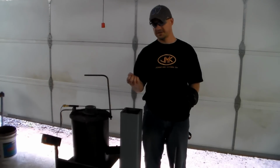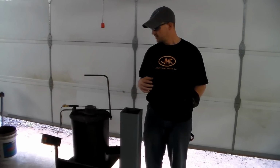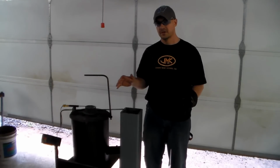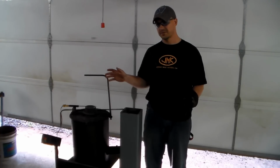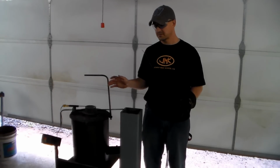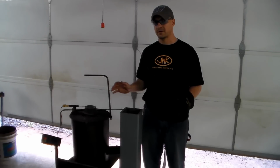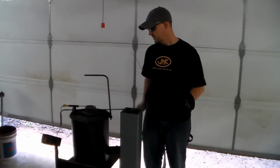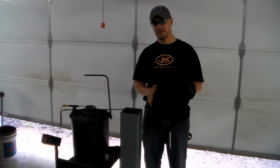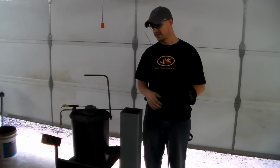and what that means in application is it's going to spit out and land on whatever is nearby. And so you can imagine we have that exact same concern with the salt, except we're dealing with nearly 1500 degree temperature here, and also the salt has about the same viscosity as water. It's very fluid, so you absolutely don't want to be messing around with this. You want to make sure that the blades are definitely dry, because it doesn't even have to be a drop of water, just any moisture on the blade.